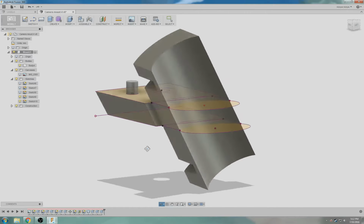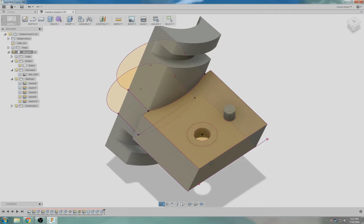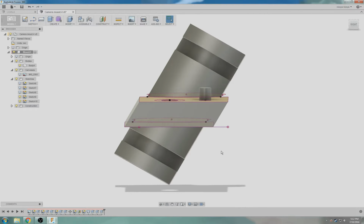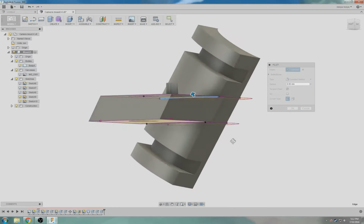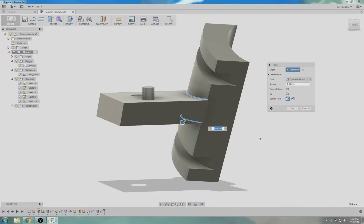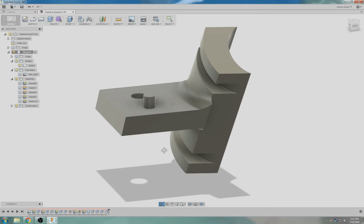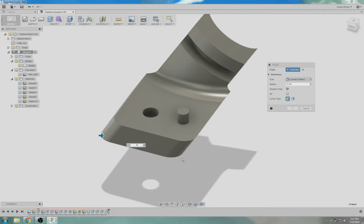All right. So this is basically in roughly the shape I want it to be in, but we need to ease over some of these edges because, like I said, if you bash your knee on this, you're going to be sad. Very, very sad. So let's see what we can fillet. First thing we want to do is put in some structural fillets here so that we don't snap this off. And this, I think I can go to 5 mil. Actually, hang on. Because we don't want to get closer than about 12.5, just eyeballing that. That's probably about as far as we want to go. So that looks fine. These corners are the corners of death. We're going to fillet those to 5 mil again.